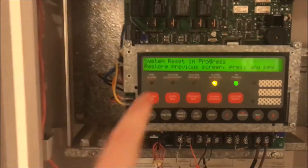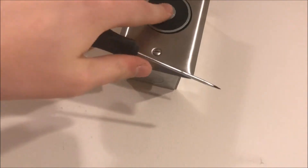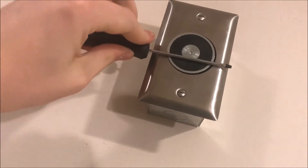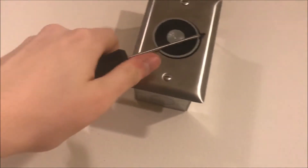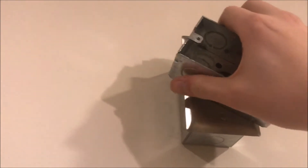You can see the magnet dropped the screwdriver — it is no longer energized. During an alarm they don't want the door to be propped back open during evacuation, so people can't just pop the door and hold it. Now the panel has reset and it's a magnet again. These are pretty strong magnets.